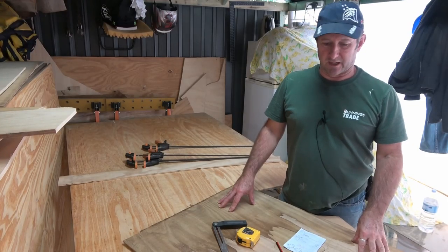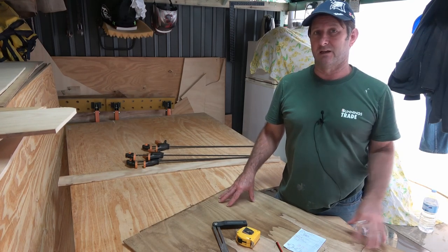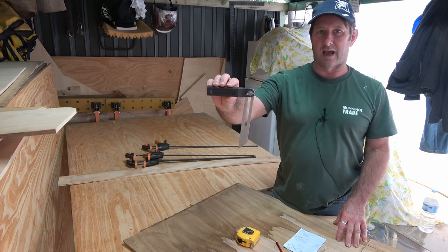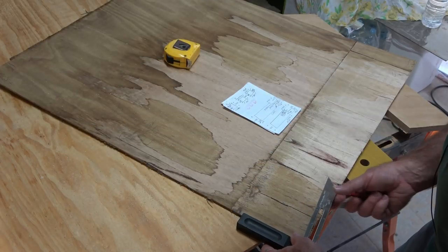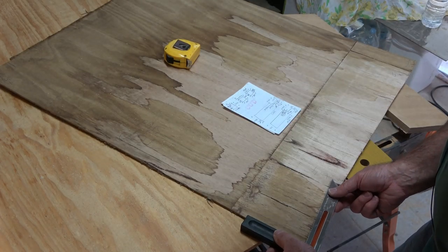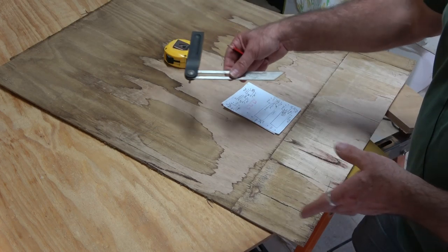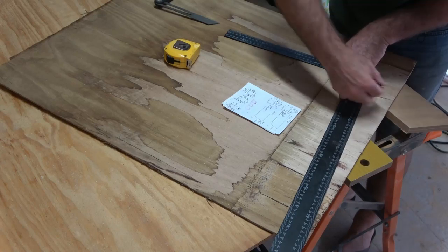I'll just explain how I make a start with cutting up one of these templates for a shape like that lining that I was just talking about. So what I've done is I've used the bevel to take off the angle at one of those corners. As I say, just using the bevel, using this as the starting edge. Put the bevel on, mark out the angle of where this piece of lining will fit against that main bulkhead, and then I'll just continue that down.